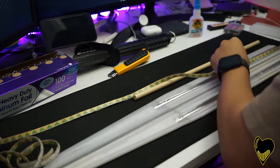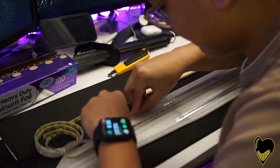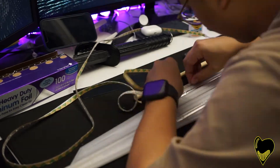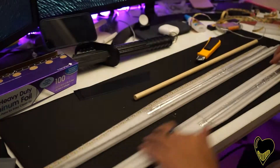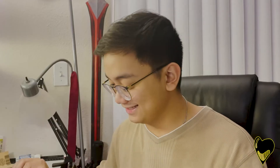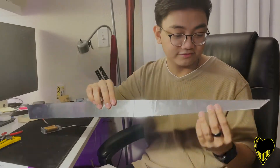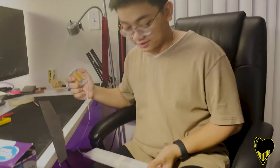It's time to install the LEDs. I modeled grooves on the insides of the blade to house the LEDs, and it worked perfectly — it held them in place. I installed the LEDs facing inward rather than outward; this reduces the spottiness that occurs when LEDs are not diffused properly. I also glued reflective aluminum foil on the inside of the black back plate to help with diffusion.